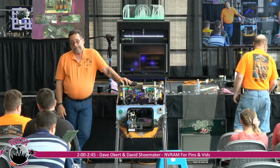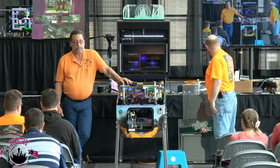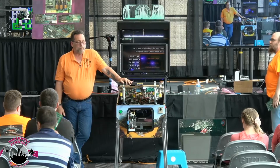I can't tell you how many times I see this. It's newer pinball machines, older pinball machines, old Bally's, new Williams, System 9, System 7, System 6, System 3, all the way through the years. And the answer to that is NVRAM. NVRAM comes in many different flavors and replaces your CMOS. NVRAM means non-volatile random access memory, and it will replace your CMOS chip.